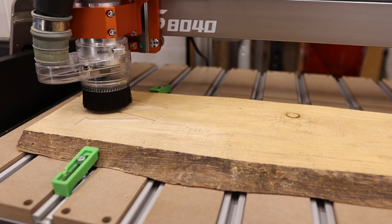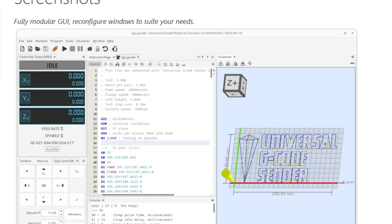My go-to CAD and CAM software is Carbide Create and Carbide Motion. While Carbide Motion is CAM software that only works for Shapeoko-based machines, Carbide Create can be used as CAD software for any machine. I recommend it for all beginners because of its simple layout, tool library for common safe speed and feed rate settings, and its preview features that allow you to visualize your toolpaths before finalizing your project. When I run my Fox Alien CNC, for example, I do all my designs and toolpaths in Carbide Create, then run them using a free CAM program called Universal G-code Sender. There are tons of software options — it's probably the largest learning curve when starting out with CNCs — but there are tons of online resources, especially YouTube videos, which dive deep into this topic. Make sure you do your research before you buy a machine to help you hit the ground running once you pick a CNC.